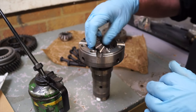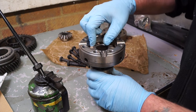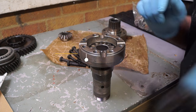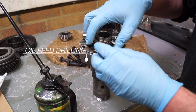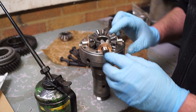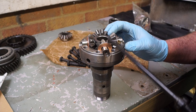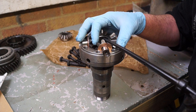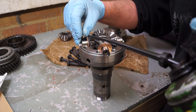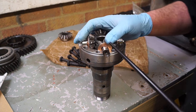We've got to get the oil around the gearbox first of all. Everything on this gearbox is splash fed. So I'll drop some oil on there. If you see the drillings there, that is where the oil feeds the components when the gearbox is running. So I'll put this into place now, make sure she turns okay, and then I'll drop some oil in between the gaps. Lubrication is always a good point, but you don't need to over-lubricate something when you're assembling it.